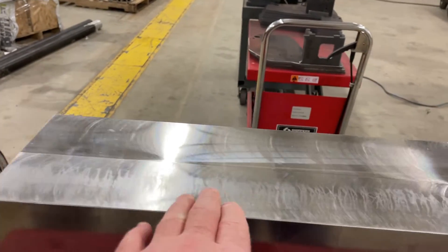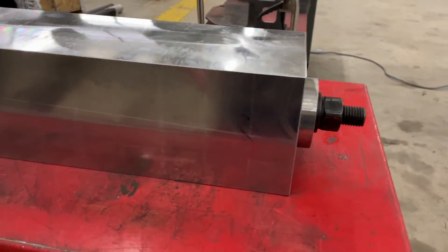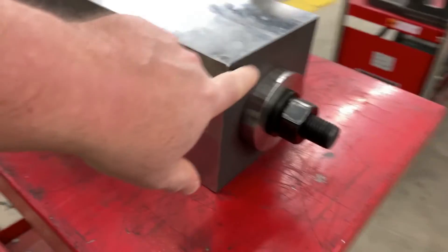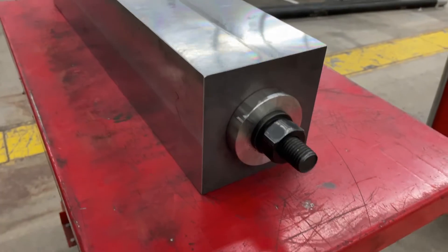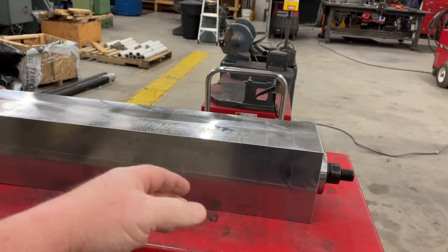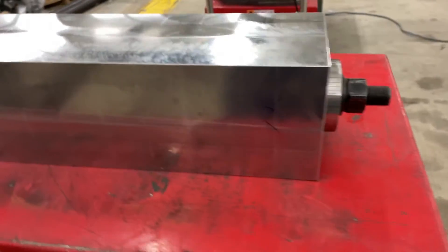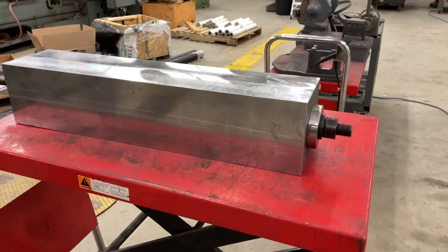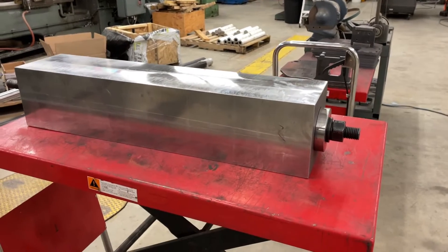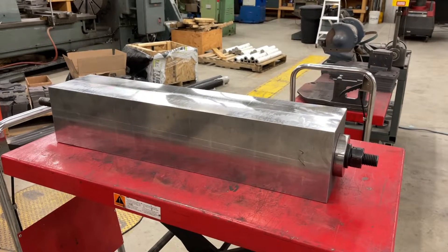You can see the individual parts. You set these up against a stop and pull them all tight against it. You have to make sure the faces are very clean, so I clean those with a flap wheel really well. If they aren't clean, your plates start to lean over, and when you machine them the surfaces aren't going to be square to the plate. Sometimes you put it together, check it, then have to take it apart and wiggle things around until it looks decent. It's not perfect — some of these will be out 10 thou over their six-inch length.